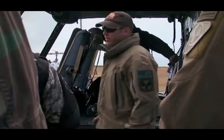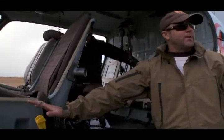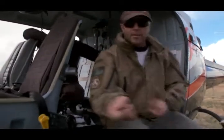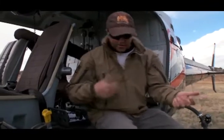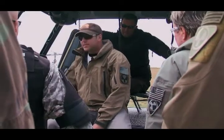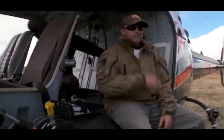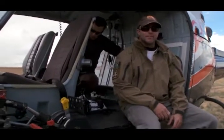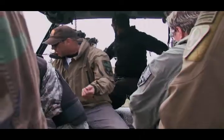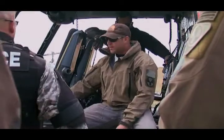One thing for the shooter to be aware of, we're on this side here, is, of course, all the flight controls and the throttle. You want to make sure that when you're on the side here and you're sliding around in your position, none of your straps or anything can get caught around the throttle. The throttle is going to be in this position in flight. If something happens to get caught around it, and you lean back and the throttle comes back with you, guess what? We just killed the flame in the engine and we're going down. So just be very aware of this. Probably don't need to be any further out than here, okay? So just be aware of that's there.